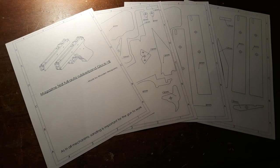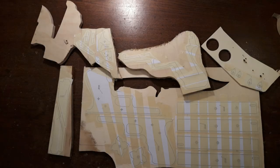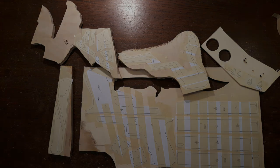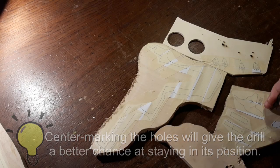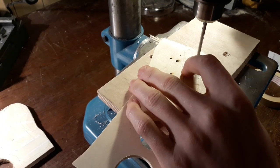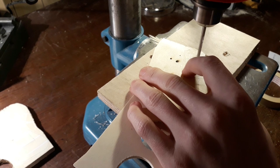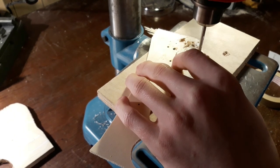The first step will obviously be to print out the templates. The download link is as always in the description below. Then you will have to cut the templates out, stick them to the corresponding ply, and center mark all the holes. What should you do next? You guessed it, drill all the holes. This operation may seem boring.